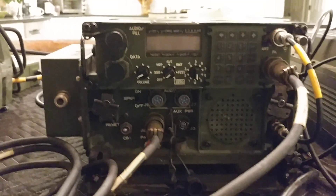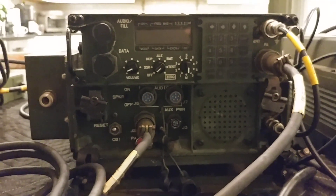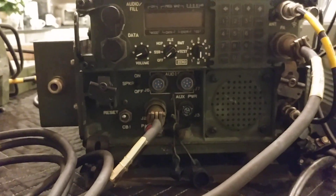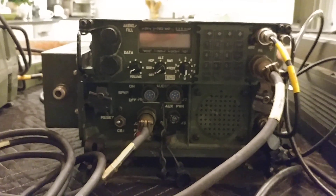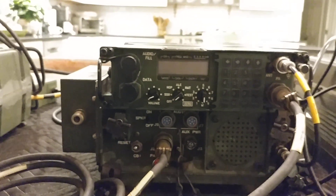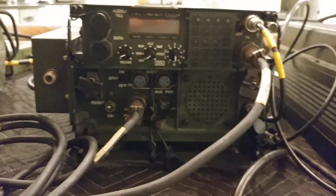We're going to be using the PRC-138 with the Harris 5833H. This amp is designed to be used not with the PRC-138, but the PRC-150, which is the successor to the PRC-138 — and the RF-5800, which is the commercial civilian version of the PRC-150. But if you look at the manuals, the manuals say that everything is identical. They say that in place of the 5033, which is the normal one used for the PRC-138, you could use the 5833. But they do warn you that the transceiver should only be used with the correct amp. Otherwise, it gives a fault — which it does. But it does seem to work.